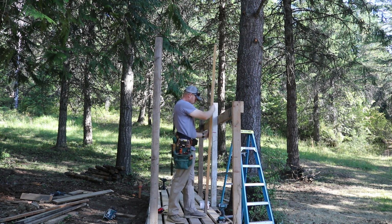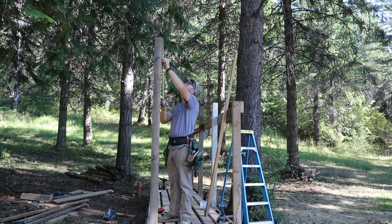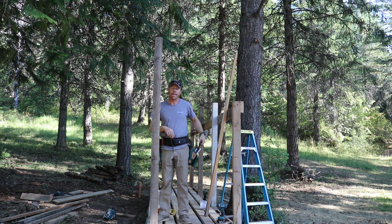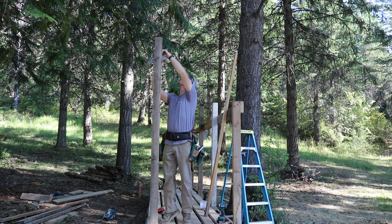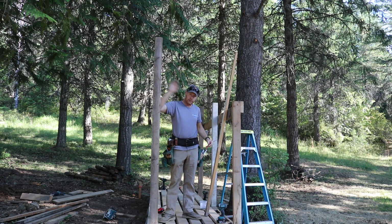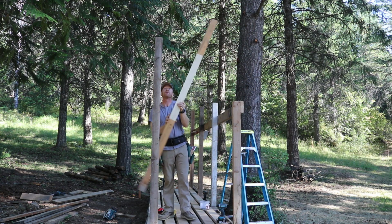So that's probably taking like 8 inches off versus a foot. It's like 7 7/8 inches. Okay. So you're thinking that would be a good spot? So now we'll rip our rafters. Whoops. That does not look like the pitch we had. I scribed it, and since I didn't scribe it the entire way, I just lined it up. I will put it back up there, just to make double sure.